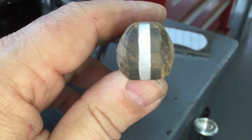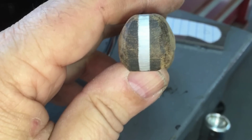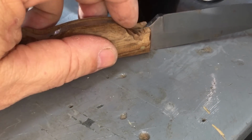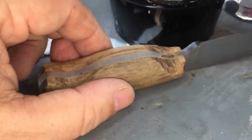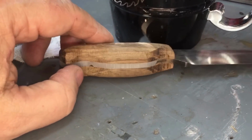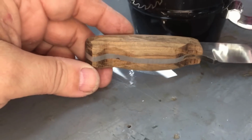I'm in the sun there, so there we go. I have to put this on my 1x30 sander now, because I have two curves that I can't get in with my 2x42, but the 1x30 has a lot more flex. And then I have my air grinder, die grinder, that I have a sanding drum on it, and some 3/4 inch drums, and that works pretty good too.